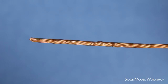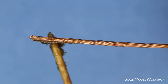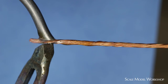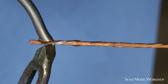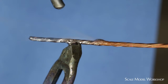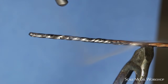A good way to get a feel for the way solder flows and the concept of heat transfer is to practice tinning some scrap stranded wire. Flux the wire, then put the solder on one side of the wire and the hot soldering iron on the other. Watch how the heat from the iron heats the wire and draws the solder down. Pay attention to how the solder follows the flow of the hot flux. Keep in mind that the longer you heat the metal, the more it will oxidize. The flux is only effective for a short while, so you'll have a lot more success if you bring the pieces up to temperature quickly.